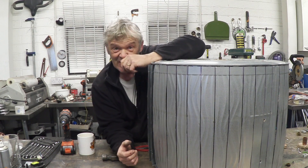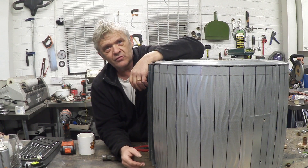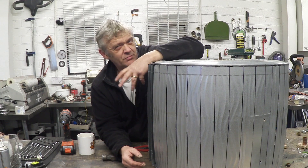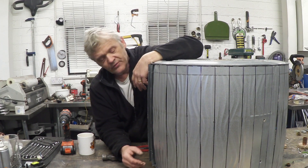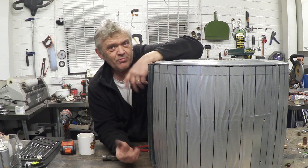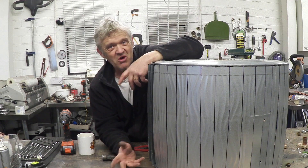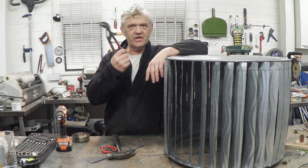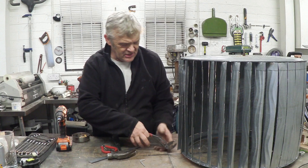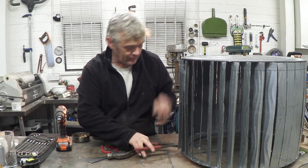It's supposed to be 36 degrees to the tangent, but when you look at different rotors there is a bit of variety. I don't think the angle is that crucial — if you bend it out so it looks more or less like a rotor you're probably going to be more or less okay. The easiest way I found is to get some grips in there and just force it around. They will tear the metal a little bit, but that's fine.